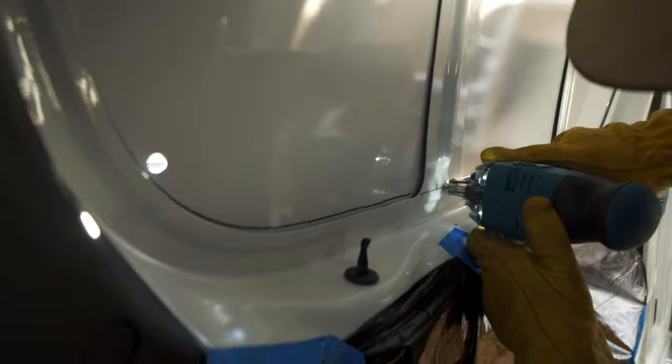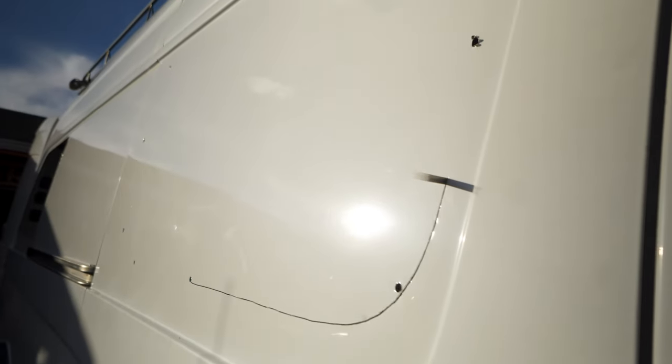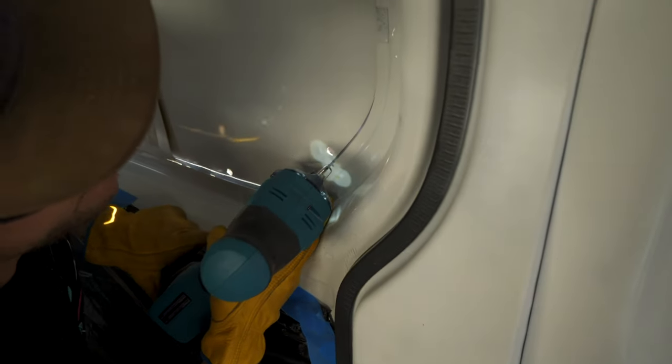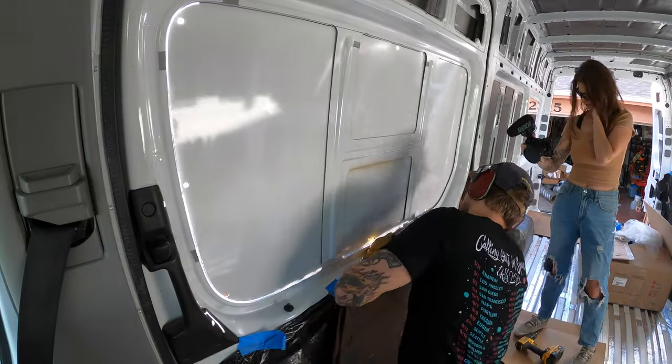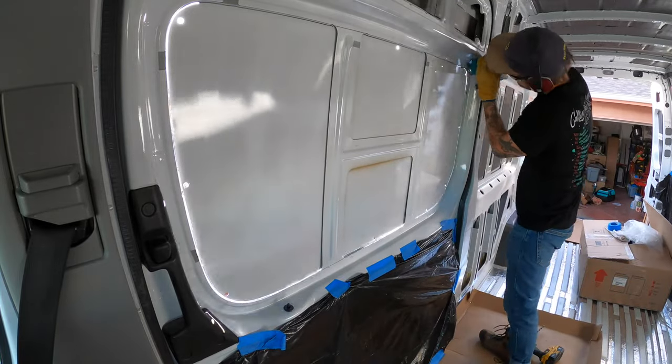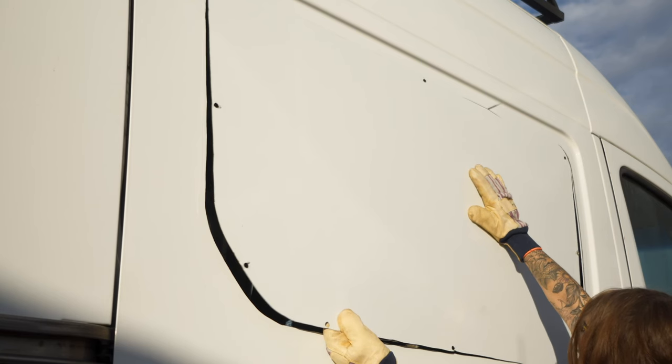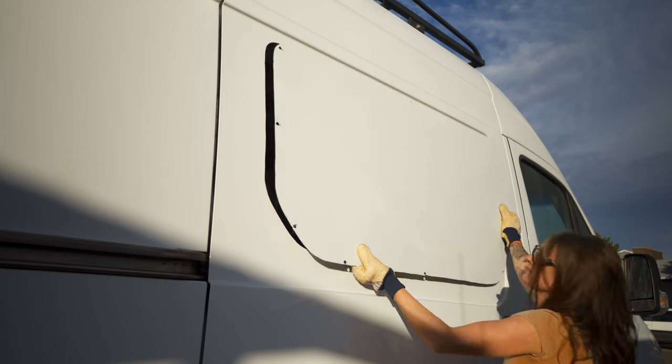Going without the guide does make it a little bit harder, but if you keep a steady hand and take your time, you'll be able to do it fine. You could keep the guide on for all of the straight sections and then come back with the guide off to get your corners, or you could cut from the outside and not have to deal with any of this, but you'd have to make a template, align it properly, and that'll probably take more time. While cutting along your line, it's a good idea to start from the bottom and work your way to the top. If you start from the top, that cutout is going to wibble wobble, and it'll get worse and worse, and it'll start to pinch your blade and cause it to snap. It's also a good idea to have someone help you to minimize the wibble wobble and catch the piece as you make your final cut.